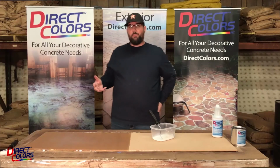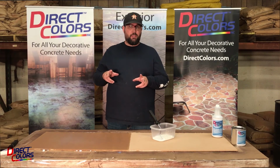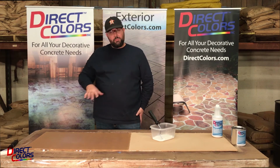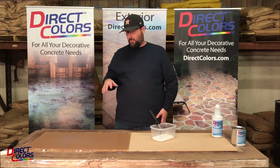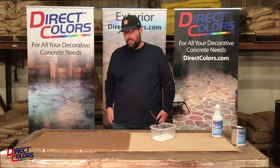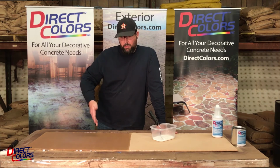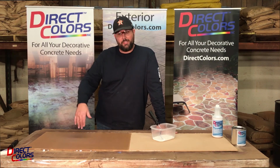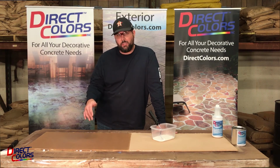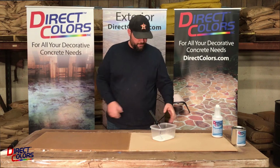Now what you'll do on a water-based sealer is you give it about 12 hours before you come back and coat it with your second coat. This is going to soak in pretty quick, like we said. So here pretty quickly, I'm going to go ahead and do a second coat so you can see what it looks like. On your second coat, if you've done one in a north-south, come back and do your second coat east-west. That way, if you've got any kind of roller lines or anything like that, it's going to help you even those out and get a nice even finish.